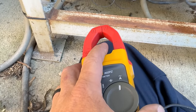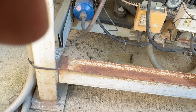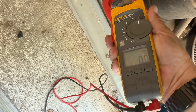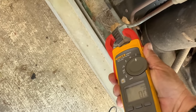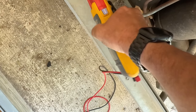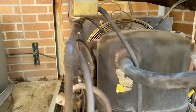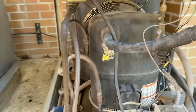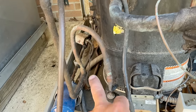So let's go to an amp reading here. We'll open up our clamp and see if the solenoid's getting power — that'll tell us if the thermostat's calling or not. Leaving the clamp open, we have no amp draw at all on that solenoid, so that solenoid is not even calling. It's not warm. Wait a minute — see, there's another solenoid there. So they must be using some sort of hot gas. Yep, right there — it's a hot gas.